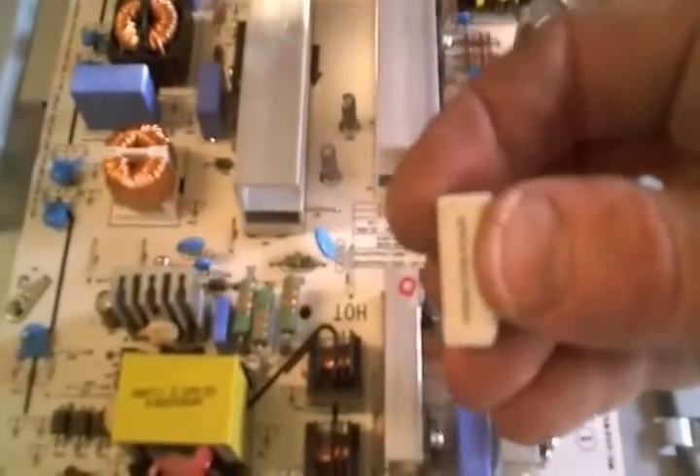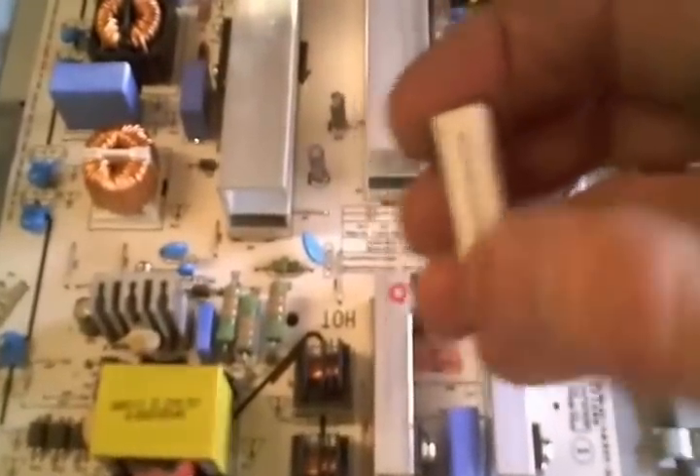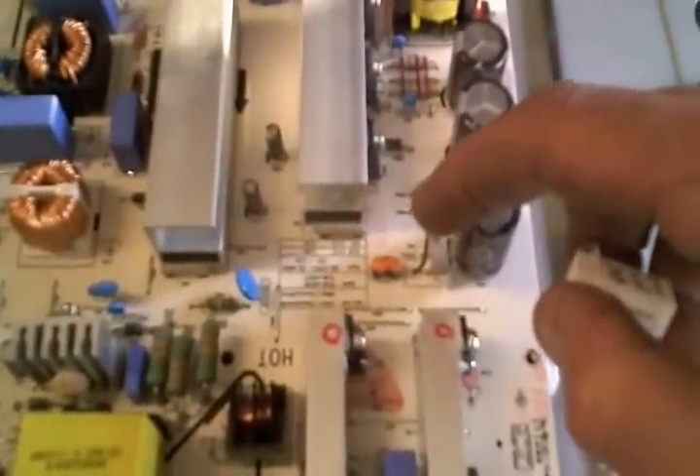Being that I've had some experience with similar power supplies, I remembered they had a fuse embedded in this particular model. One like it that didn't look like a fuse — it looked more like a resistor, a high-wattage resistor with a couple wires at the bottom. And right away I found one over here.